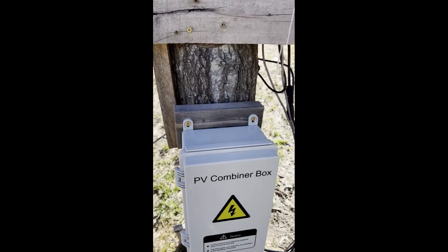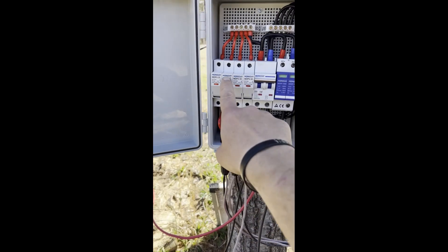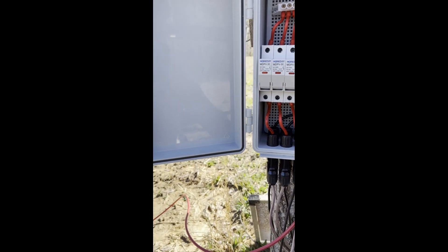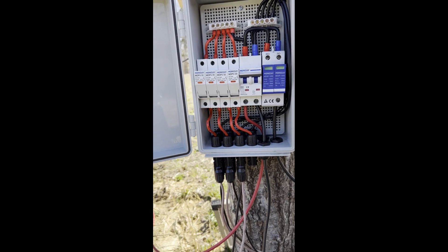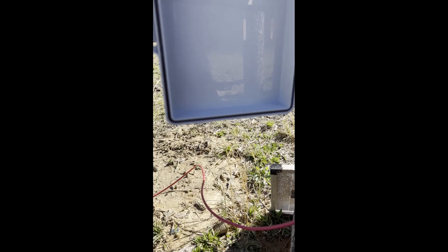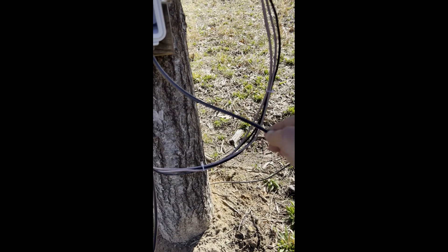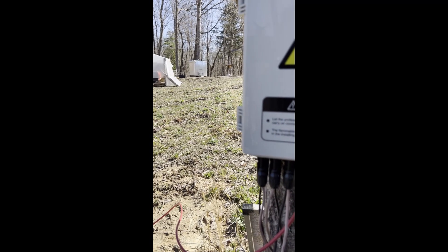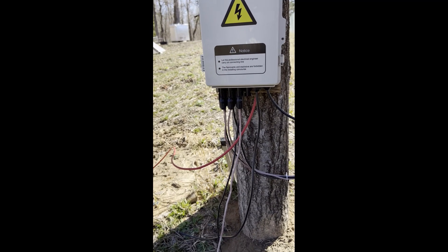You can see how I do that through this combiner box — all the wires come in here, and it has room for four inputs. That's the main switch. These four inputs combine to one main output, which runs back to the charge controller. The wiring from the panels is 10-gauge wire going into the combiner box, then it comes out at 6-gauge wire, and then the wire running from the batteries to the charge controller is 2-gauge wire. That's really the gist of my setup.